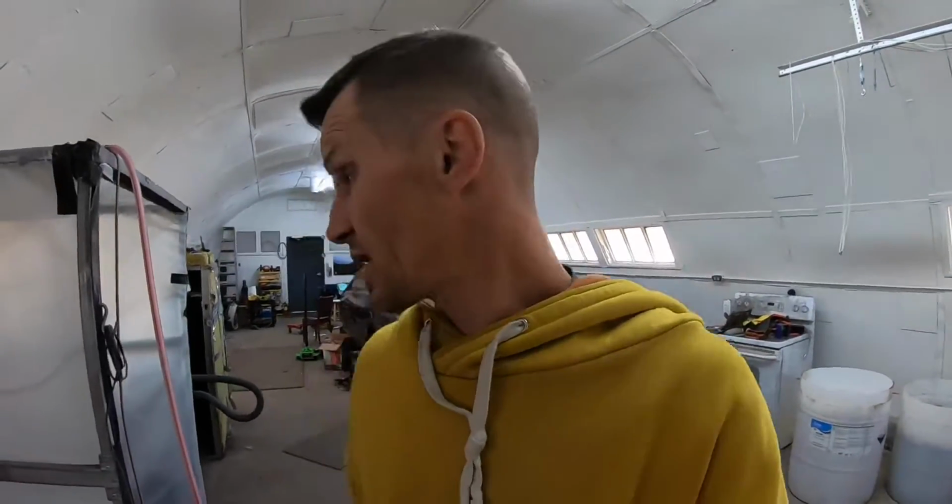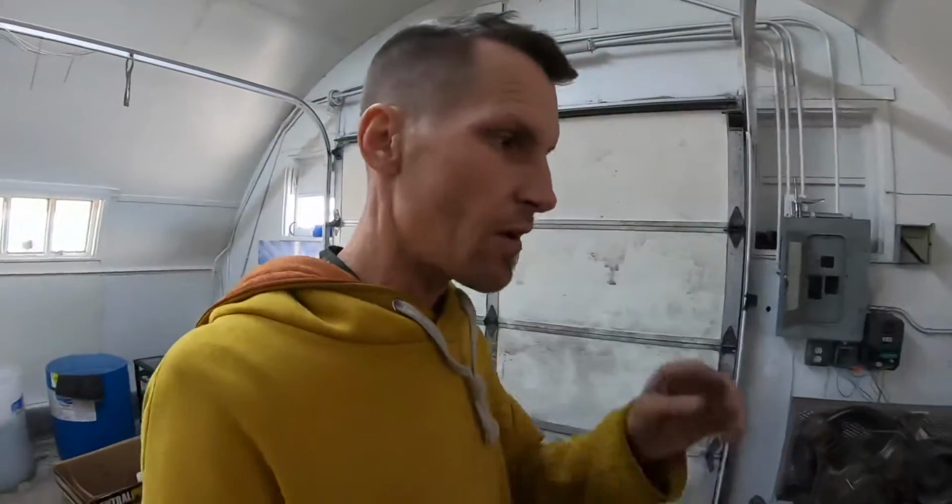Now, when we did that, I was actually having electricity build up around my person. You could see electricity jump from me to the gun, or if I was too close to the booth, from me to the booth. If I had something with a zipper on, between the zippers, it was really weird. I pulled the trigger and it would instantly cling me up, my hair would stick up, and you'd get static sparks. You don't want static sparks, because if there's powder around, it could ignite the powder. So there was a very big issue there.